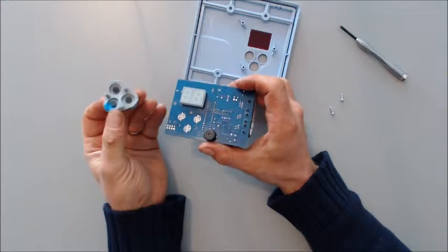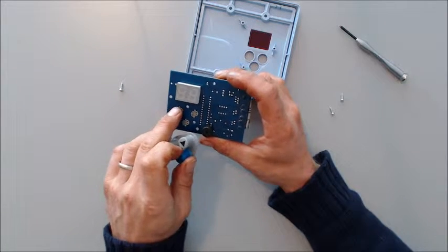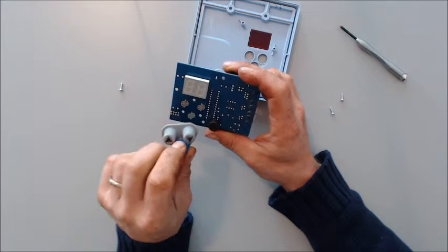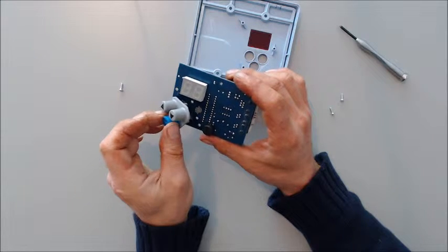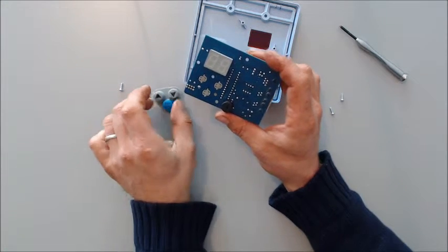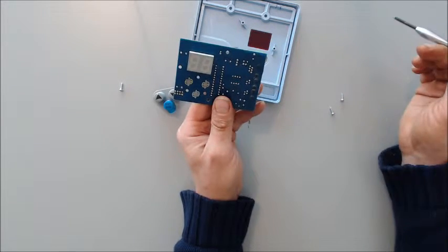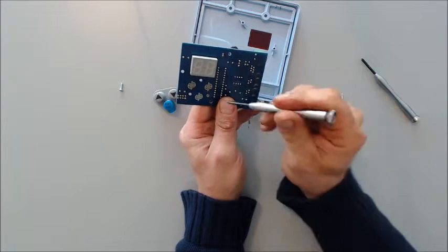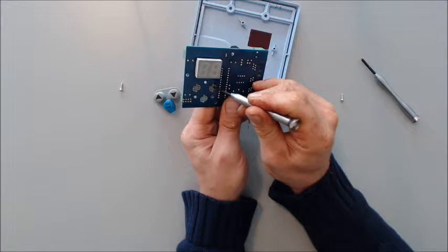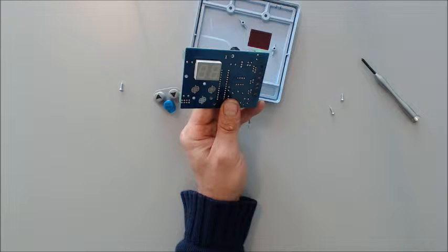You want to aim these rubber stands here. You can see the alignment: you've got the up and down button sitting like that, and then the start button down here. Another way, if you don't have new buttons around, you could turn on this circuit and then use that flathead screwdriver to make a connecting point across here, because that's essentially what the buttons do. If a piece of metal won't make a connection here, then you know there's something wrong with your circuit board.